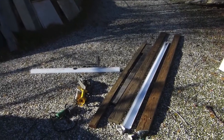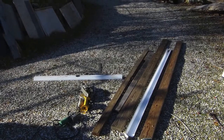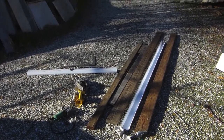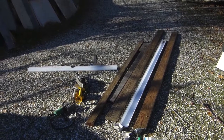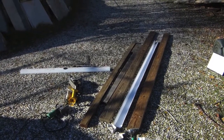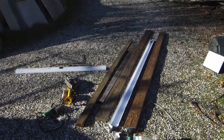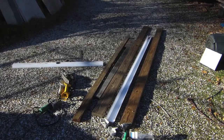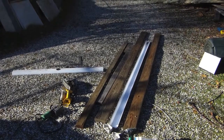There's a 10-foot gutter. We're going to cut those 2x6x12-foot pieces down to 10 feet 8 inches long — that's to give a little extra support on the ends of the gutters for large buckets that might hang over the end. I generally use a 2x8 instead of two 2x6s and rip the 2x8 in half to about three and a half inches wide, because you can get a straighter 2x8. Two by sixes can be cut from smaller newer growth trees, and that's also why you don't want to use a 2x4 — they're cut from really small new growth trees and it'll be virtually impossible to find a straight 12-foot 2x4 that stays straight, especially in pressure treated.